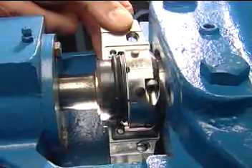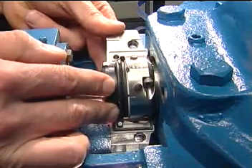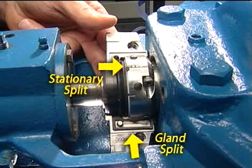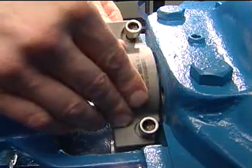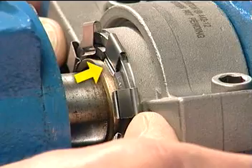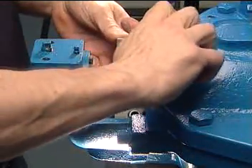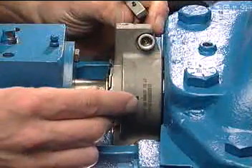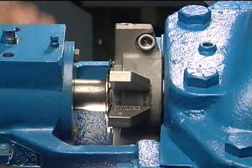Take one gland half and place it around the external seal components. The gland split should be 90 degrees from the stationary seal face splits. Place the other gland half around the seal and bring the gland halves together. Align the gland springs with the slots in the back of the stationary. Fully tighten the gland socket head cap screws — these gland cap screws can be installed from either side. Install the adjustable gland tabs as needed for a 2, 3 or 4 bolt pattern.